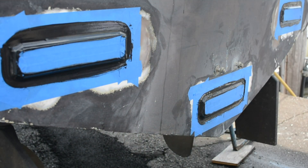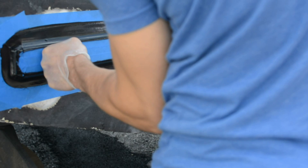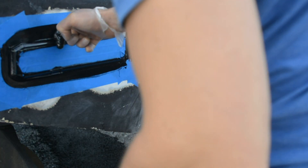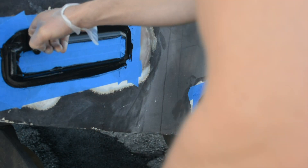The lights are underwater and they typically get painted up to anyway, so it doesn't need to be perfect if you're not super clean with 4200. There you go — nice clean seal. At this point you're better off just leaving it. You're tempted to keep touching it and messing with it, but you're better off just leaving it. Maybe give it one more press to make sure it's all the way against the boat. You can see using the knuckle of my forefinger gives a nice clean uniform bead — if you look at the top edge of that light, it's super uniform, nice and clean.